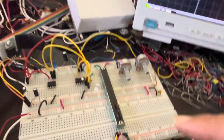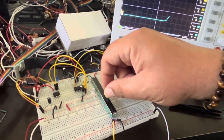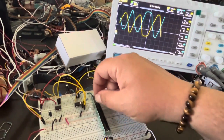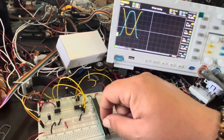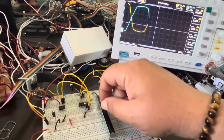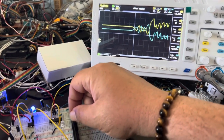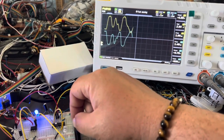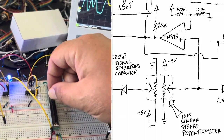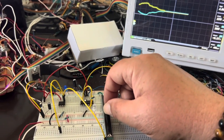The slider is at the lower pole here — that means it's at 5 volts. If I slide it, you can see what happens to the two outputs. I have a comparator on one of the outputs. You can see how easily this slides and gives us two different tracings of analog 0 to 5 volt voltage. If I go below the halfway point, the light goes off. If I go right to the halfway point, it's barely on.